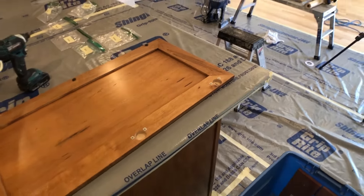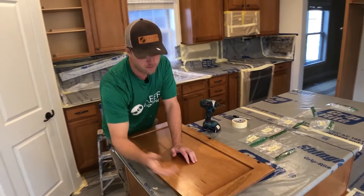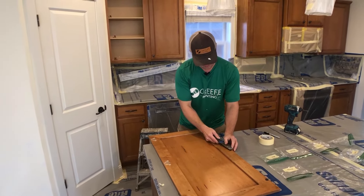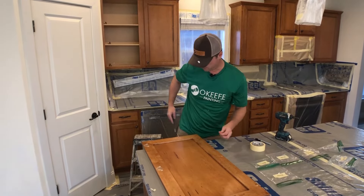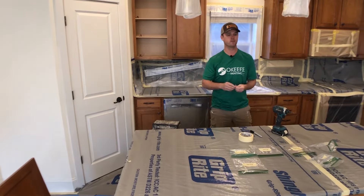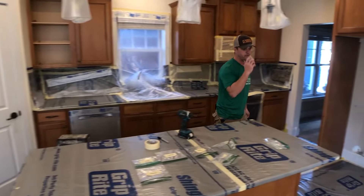Put a piece of tape over the label right at the hinge area — that's one of the only places we're not painting on this door, so when we come back for reinstallation we can pop that tape off. These nubs are going to come off with the degreaser, or just pop them off now and throw them in the garbage. All these doors go inside the transport box to bring back to the shop tonight. Ideally with a two-person crew, one person splits off to handle all the doors while the other stays here with the boxes and gets them sprayed out — that's the fastest way.